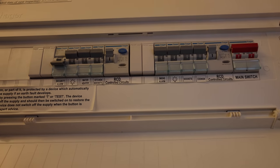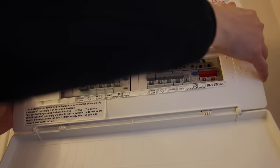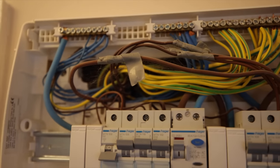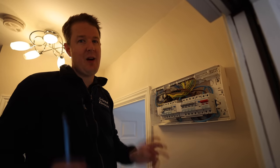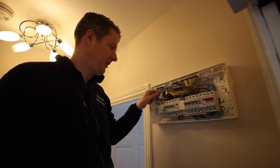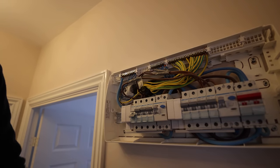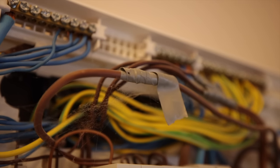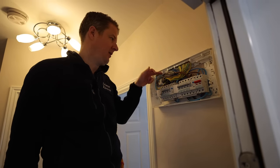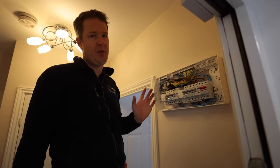We've got spare ways here. Only qualified electricians should remove the cover. This is what I find soul-destroying about new build properties — they're supposed to be done to a high standard, but whoever installed them originally cut the wires too short and had to put crimp connections in to extend them, which adds potential weakness and resistance. It's a shame for a brand new install. It's a classic experience we have often with new builds. But inside, it's not dangerous — there is enough space to run in a new cable.